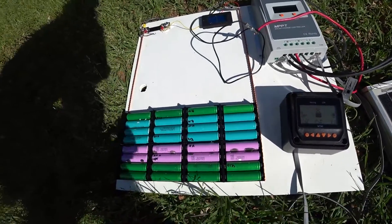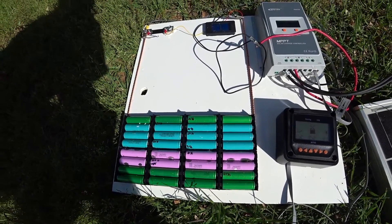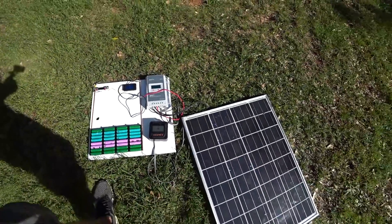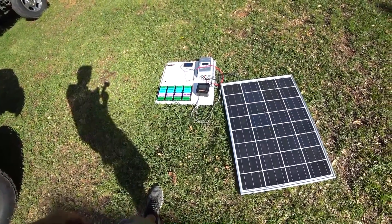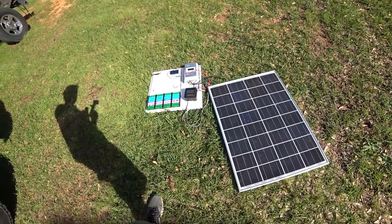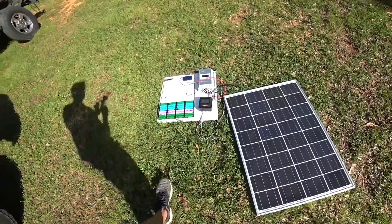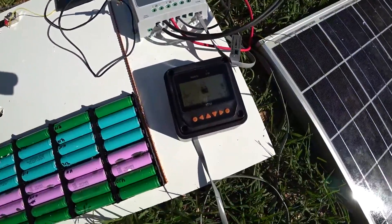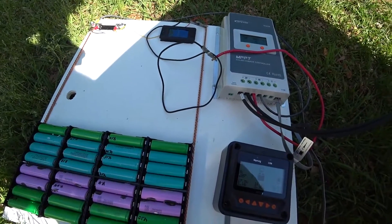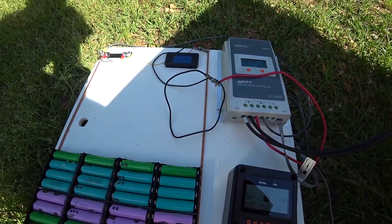I need to equalize these cells too. I'm going to figure out a way — I can use a hobby charger at least to get them started. It's such a small cell bank I'm not going to worry too much. I'm just going to double the banks, and one or two panels might be enough. I'll have to see how much it uses overnight. I also need to shield the positive side over here — right now I'm just doing testing and I need to be really careful not to ground it out and short something.